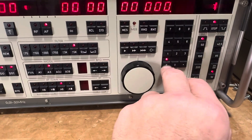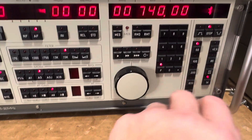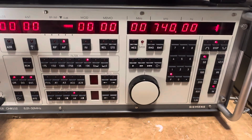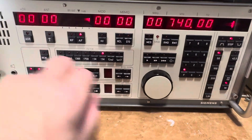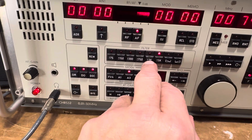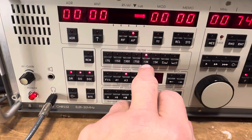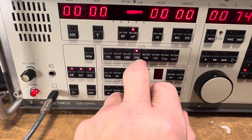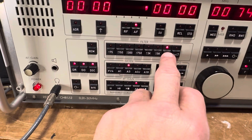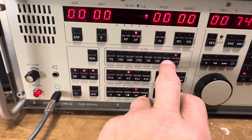You have to clear it and hit the function key again to get it to work. That's Toronto on AM radio. This is at a 10 kHz filter. It doesn't make a lot of difference, but it takes some of the treble off to go to the 6 kHz filter. Obviously even narrower below that — that's 1.5. And the sidebands.